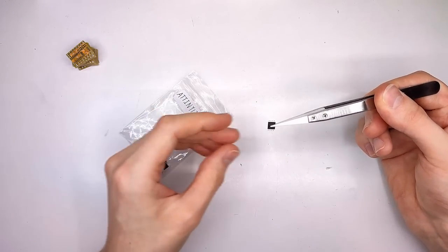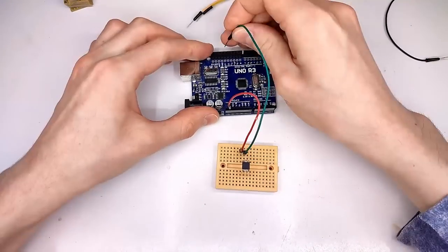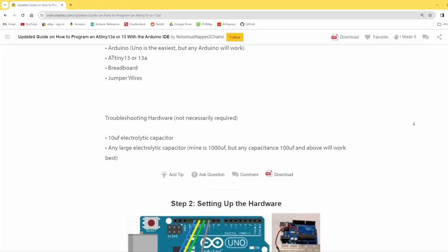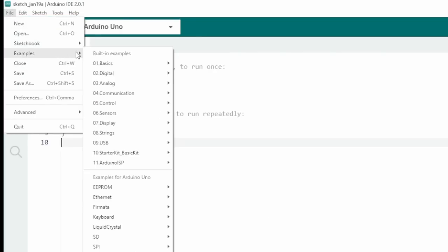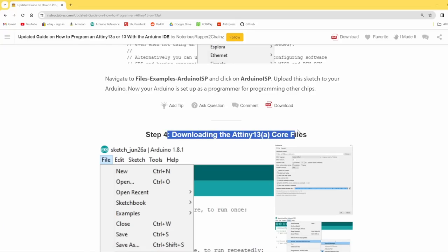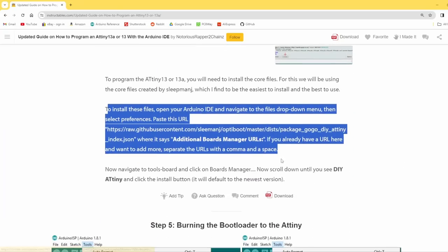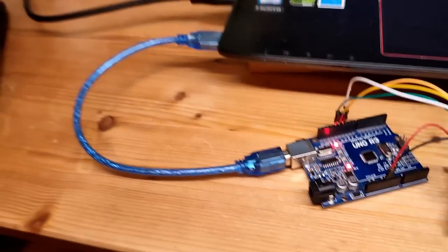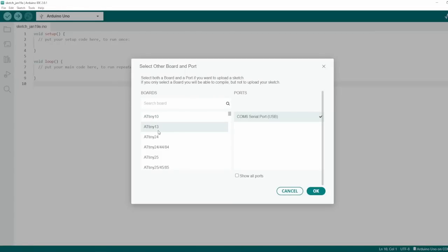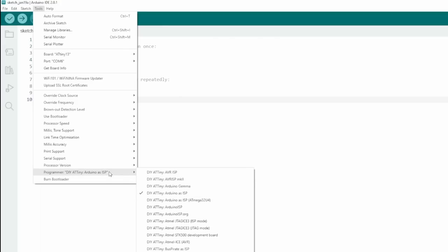To program a brand new ATtiny, I first need to solder some longer pins to it for use on a breadboard, then wire it up to use an Arduino Uno as an in-system programmer. Go to Examples and upload the Arduino ISP sketch to the Arduino to turn it into the programmer needed to flash code onto the ATtiny. Then download the board manager files — those are like a library that handles the direct negotiations with the ATtiny. With the ATtiny connected and the board set to ATtiny13, we get a whole slew of settings in the tools menu. Make sure Arduino as ISP is selected for the programmer, and the correct processor version.